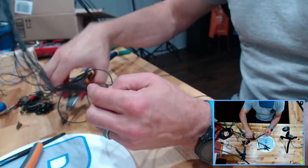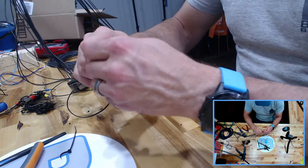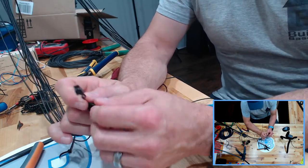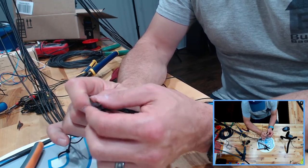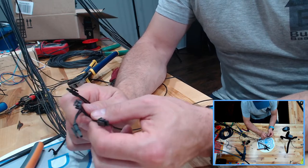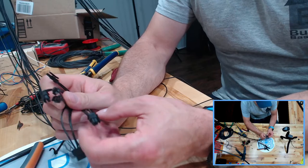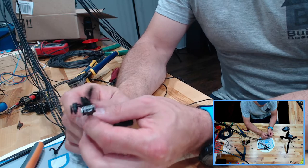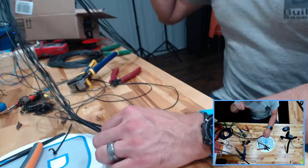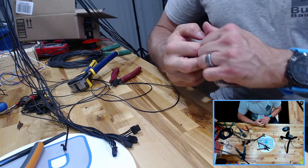Bunch right here. I'm going to cut this zip tie off. Zip tie is kind of a placeholder. Put these all together for me. And what I've done is my twosies are for the hot end. This is using a 20 gauge wire, slightly larger wire gauge, just to handle the additional current going through there. I got fan. I've got a thermistor. I've got the inductive probe, and then I've got the extruder motor right there with 4 on it. So my inductive probe is using 4 horizontal, whereas my extruder is using a 4 square. So it's gonna be hard to mess those up, but it's gonna be even harder once we mark these a little bit. And you watch, this is gonna kick my butt.